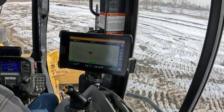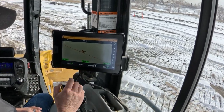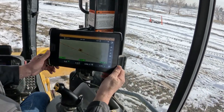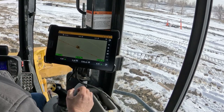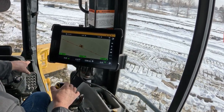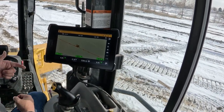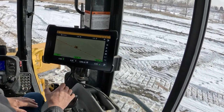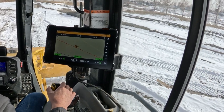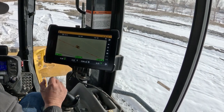The other cool part is angling the blade. Right now I'm close to the line, but when I angle the blade the corner of the tip actually moves over. It adjusts for that because as I angle the blade all the way in and over, you can see it's off a little bit — that blade tip is coming in so the dozer has to move over to adjust. When I bring it back the other way, it adjusts to come back — and it does so really, really quickly.